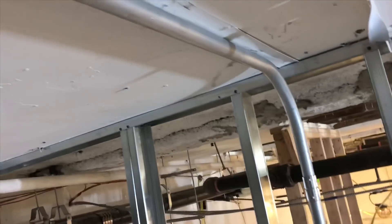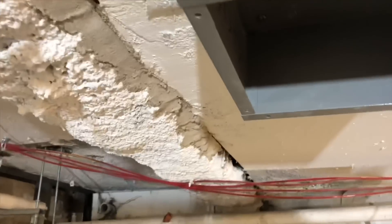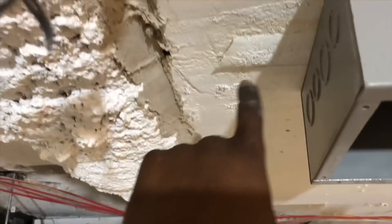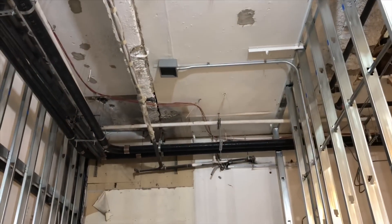We're going to hit the ceiling — we're good to go. We're going up with our 90, right with our box offset. Now we're going to bring a pipe from this side of the box going out here, do a box offset, come down with the pipe right here, go up in the ceiling eight inches, then go to the wall over, come down right in the center of the room at 55.